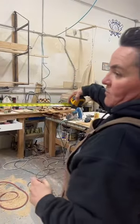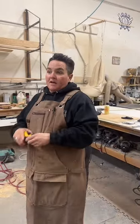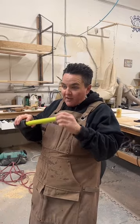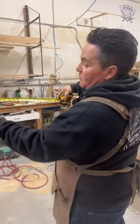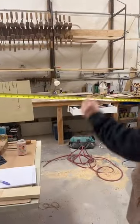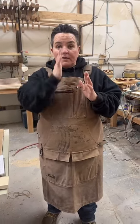And usually studs are 1.5 inches wide. The space between your studs is going to be 14.5 inches. And instead of measuring 14.5 and then 1.5 inches, you can just simply go and mark 16 and put the center of your stud there. If you're not sure what a stud is, it's one of those vertical pieces of lumber inside your wall, with drywall on it. The standard here in California is every 16 inches.